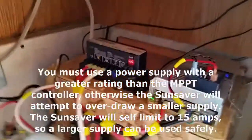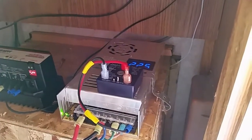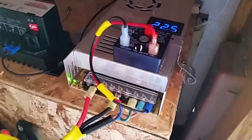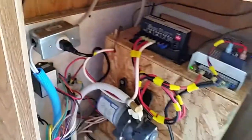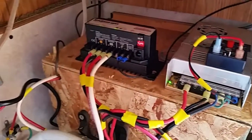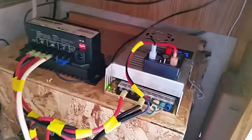That led me to the Sun Saver — it's a 15-amp solar charge controller. I got on eBay and this little device here is actually an LED driver. A power supply has to be higher than the voltage you're going to charge at for the charge controller to do its job, so I got a 24-volt LED power supply and wired it up to the charge controller. I installed an outlet in this box here. One problem I ran into was that if you turned off the power supply and turned it back on quickly, it would cause the charge controller to click. Customer service didn't have a workaround for it — they thought it was something to do with the power supply.